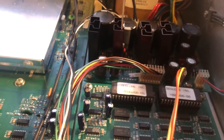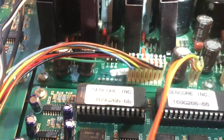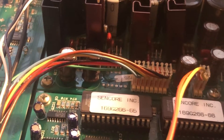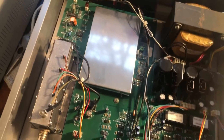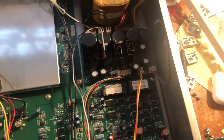Before going looking online, I noticed as I was doing this that there is some capacitor leakage right under there — you can sort of see the reflection. This is the power supply board right here, and it looks like those two caps right there are leaking. So that makes me question those as well. I didn't see anything from the big capacitors, but I'm going to take those out and test them or replace them because they're leaking. I can't just get an old piece of tech like this and trust it's going to work immediately. So I had to take it apart and I didn't see any exploded caps or burns on the board. I'm just going to take out the power supply, replace those caps, and hopefully that's all that's wrong with it.